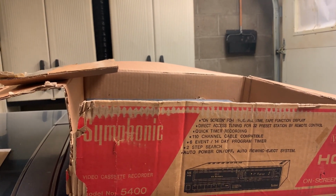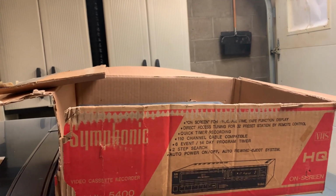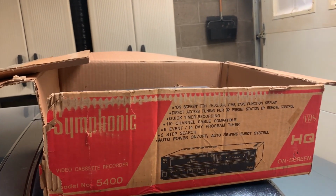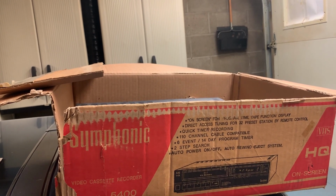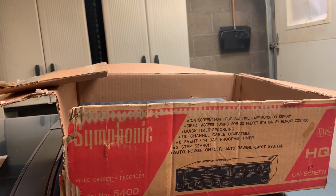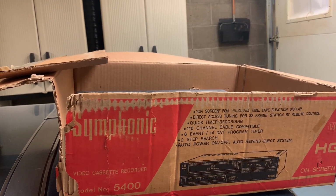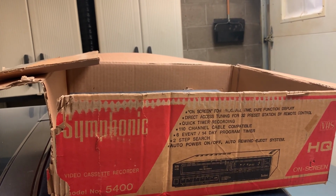And unfortunately, even though that was okay, let me back up. That one had their newer mechanism that Funai designed themselves. It was still made in Japan, and it was the last year it was made in Japan. I had one. Unfortunately, even though it was still made in Japan, it was utter junk. It had a switching power supply. I recapped it. It worked, but then the VFD broke somehow, and then the mechanism, something else failed, and I just got rid of it.